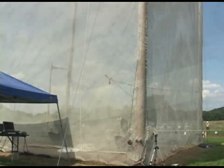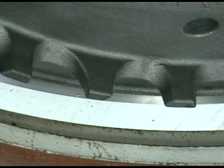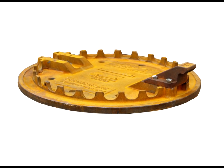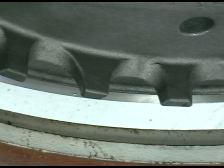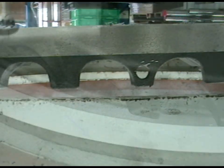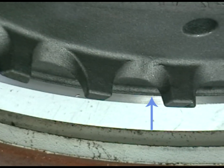The answer was found in a concentrically displaced skirt integrated into a manhole cover casting containing a spatial array of angled and splayed exhaust ports. These exhaust ports direct the expanding gases into an area defined by the surface of the manhole cover seat, outer skirt wall, the inner frame wall above the seat, and the underside of the manhole cover periphery.